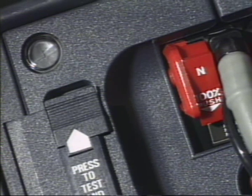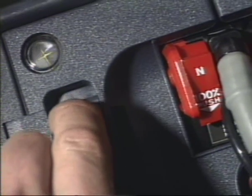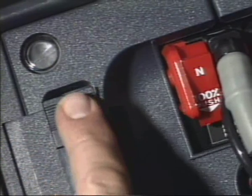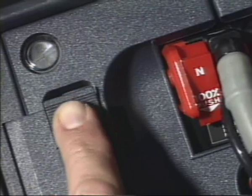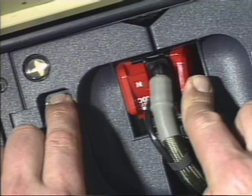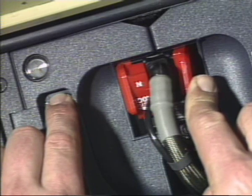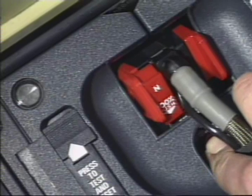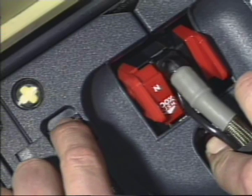In-situ test. The reset test: the blinker turns yellow and goes black again, showing that the regulator is leak-tight. Press the harness inflation control. The blinker turns yellow and goes black again, showing that the harness is leak-tight. The on-demand system is tested by pressing the emergency rotation knob.